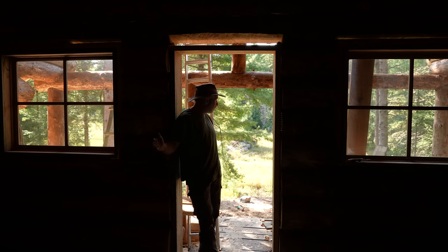Anyway, pretty happy with this week — got the floor in. I'm planning on doweling it: I'll take out the screws that are just there now to hold the floorboards down so they don't warp and cup. If I don't do that, for sure they're going to start twisting, especially with the variable heat — cooler here, warm by the wood stove. There's going to be a lot of movement. It's not tongue and groove, it's just rough-sawn boards, rough white pine.